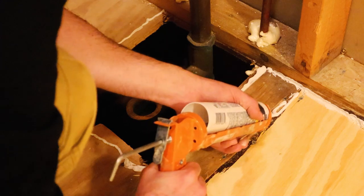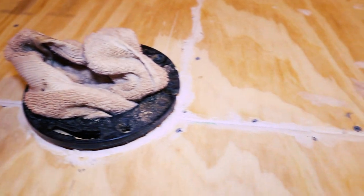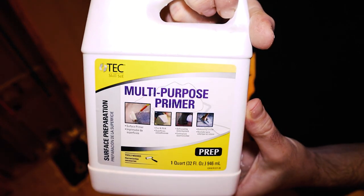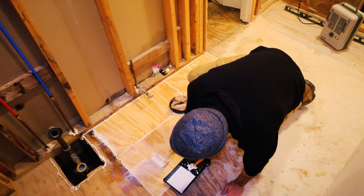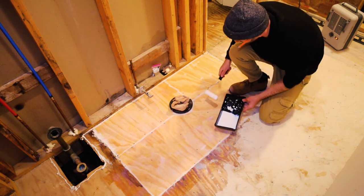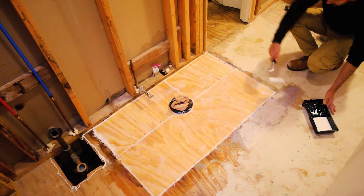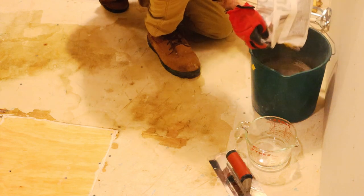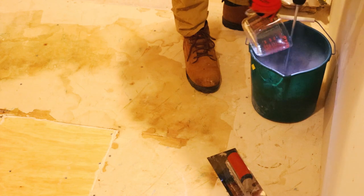I'm caulking a border around any holes and filling cracks so the floor leveler does not fall through the floor. Before applying the floor leveler you have to prime the floor so it gives the leveler something to actually stick to, something to bond to. At first I was unsure if I was doing this right because it was super clear — I was wondering if I mixed the product correctly — but this is the way it's supposed to look. Now I'm going to mix up some of the floor leveler and it's a lot thicker than I expected.